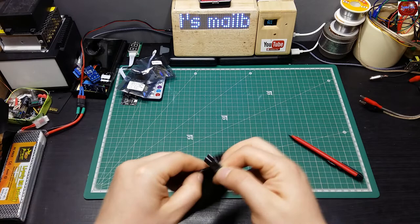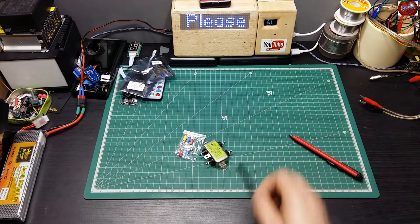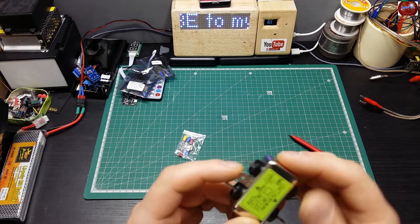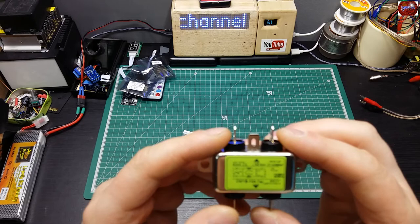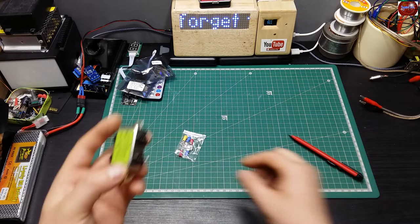Oh yeah, so this one is also for the amplifier project, because it's an EMI filter, so it's going to reduce the noise that comes from the AC mains. Practically you can connect here in with the earth and two, and then you go to the load, to the amplifier. So I also have this one that I can clamp cable.